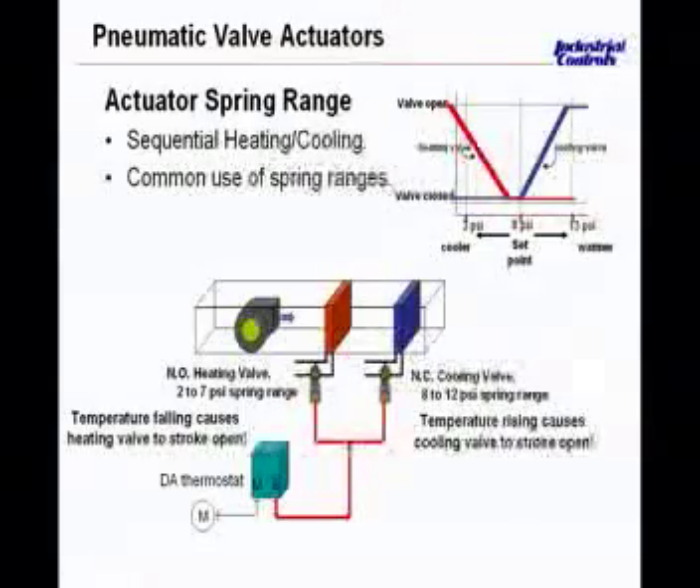In the case of these valves being fitted with positive positioners, we could make that dead band anything we want it to be. When you flip open your Honeywell or Johnson or anyone's catalog, you're going to find some very standard spring ranges. But if you needed to sequence several valves, you would have to have positioners only because you'd never find the spring ranges you wish. This allows you to not only maintain very precise motion of the valve stems, but it allows you to sequence outside of spring ranges that are commercially available.